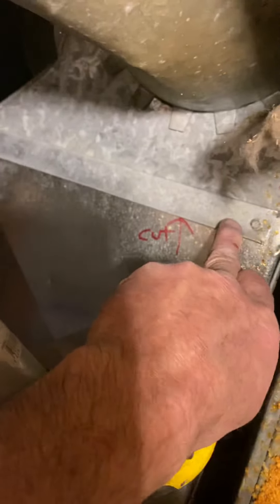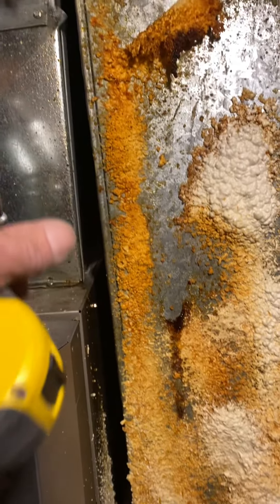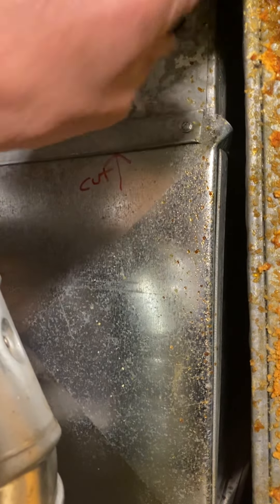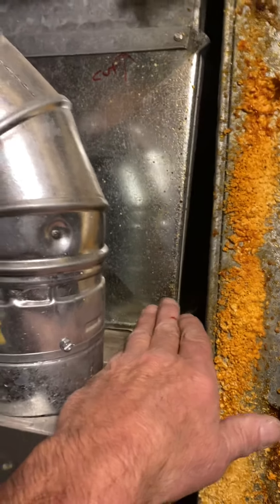The coil is actually 14 and 5/8 inches tall, and that actually goes up to this line right here. So I made a piece of duct just at this height of the cut line. You could probably slide the coil in from the back and just notch the duct up in the back — there's just one piece of duct in the back. Just notch the duct up in the back to slide the coil in, then patch it back. That would be the easiest thing to do — uncase the coil.